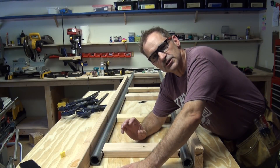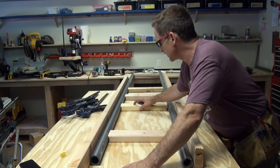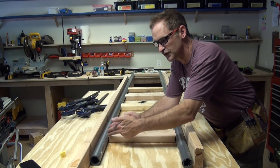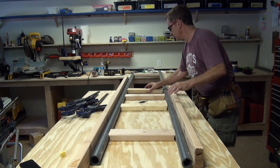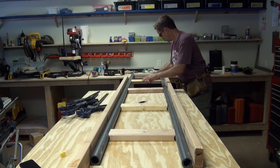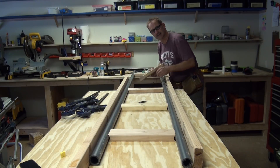For a straight and level piece of track, what I'm doing is I'm putting the ties every two feet. So every two feet on center we're going to have a tie, and I just marked them off — starting one foot in so that I can manage my connections. Starting one foot in, I'm just going to put them every two feet or so, and that's how that's going to work.